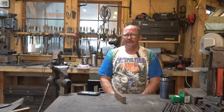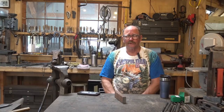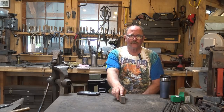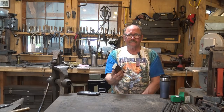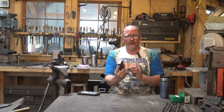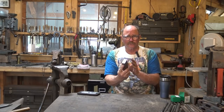Now there is one little problem in doing this — what do you forge it in? What do you get it hot in? Wrought iron is forge welded. That's how it's made. It's all forge welded together, so it is a forge welding product right from the start, which means when you work it and you're doing a lot of reshaping, you should try to do it at welding temperatures so that you don't break the welds apart.